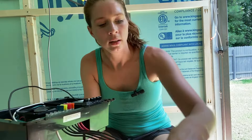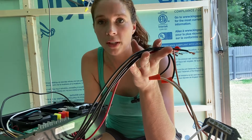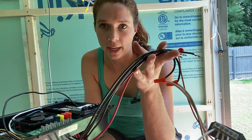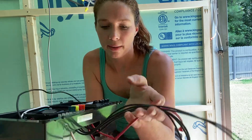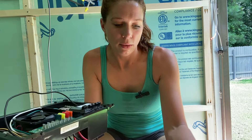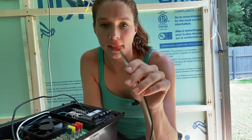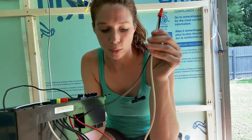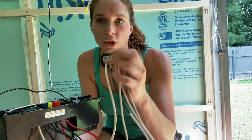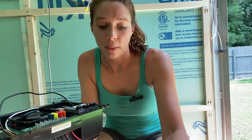Don't hook them together — put them both in the common ground. After that, you are going to have all these wires right here, and these are going to be all your separate 12-volt systems, which is why I have my fuses hooked up right here. You can just pick whatever size fuse you think will work. My first one looks like lights. Basically you'll have a positive and a negative — the positive is going to go right here hooked into one of the wires in your breaker, and the negative is going to go to your common ground. It's going to be the same thing for every wire that you have coming into your 12-volt system.